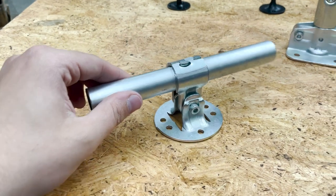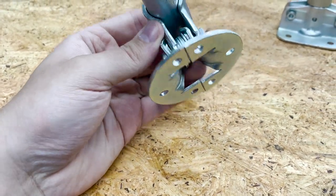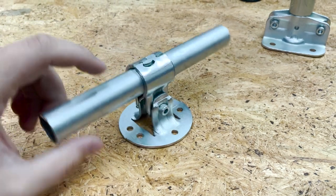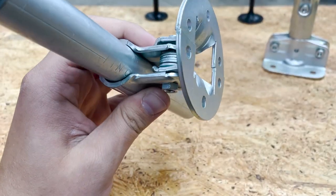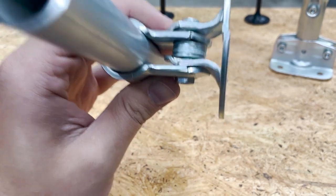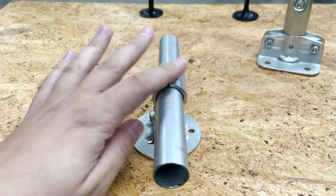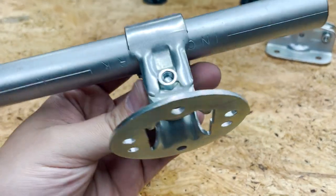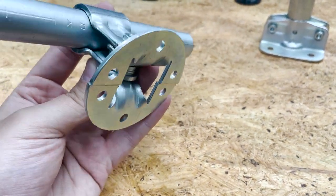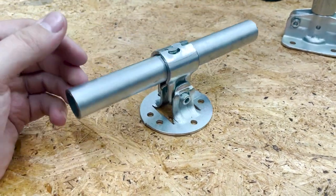Next up is a solution that I really like the idea of, but it doesn't really work that well. Basically this is a puzzle piece clamp attached to an adjustable angle base. Because both the adjustable base and the puzzle piece clamp are made to squeeze an end clamp inside the two halves, they don't really mesh well together. So what I've had to do is use five washers in between the halves — one puzzle piece on the outside, base, five washers, puzzle piece, then base. You'd also have to get a longer bolt, probably at least 30 millimeters, to go through all four pieces and the washers. I think it looks cool, but it may not be the right solution based on the amount of work you have to do to get it to work.